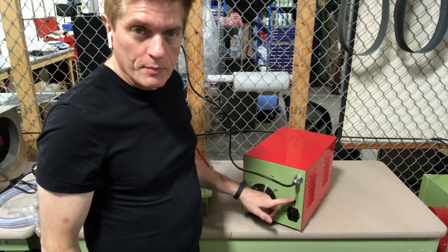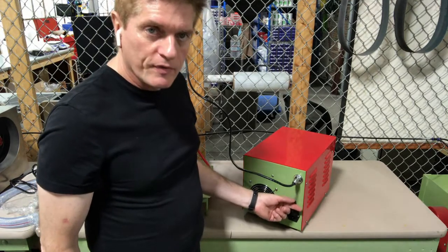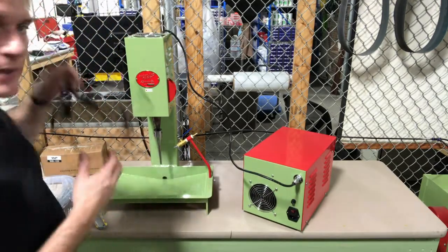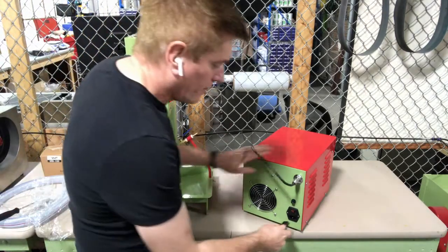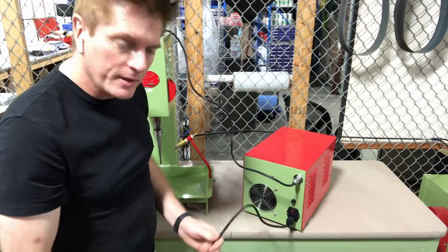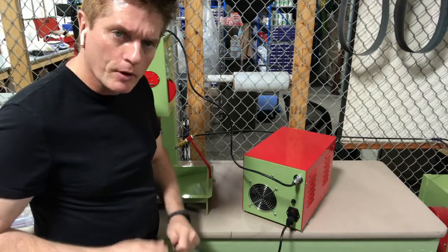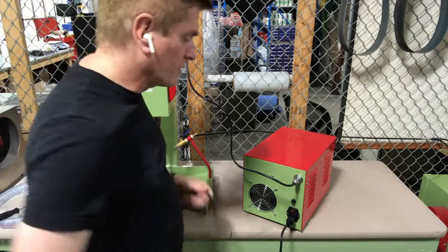The fuse is designed to keep you from blowing your unit up. So if you see that you're blowing fuses, you want to look at: do I have the thing cranked up too much? That's one of the typical problems we see beginners do — they don't have the silver solder of their tip in very good, and it's not drilling well because energy is not being transmitted well through that tip. So they crank up the big black knob, and then they blow their fuse, and then they're like, my machine's not working. So we'll get you guys trained on how to do that — that's what these videos do.